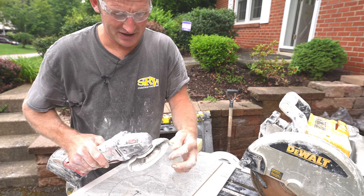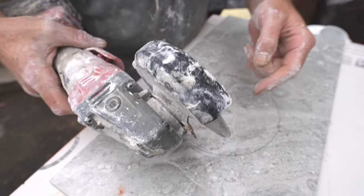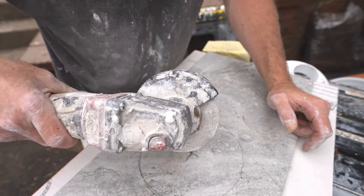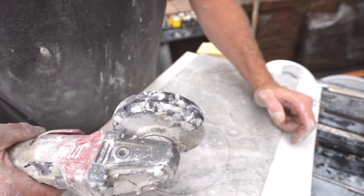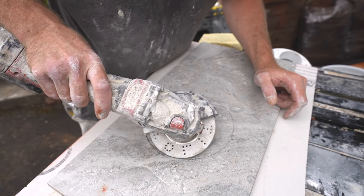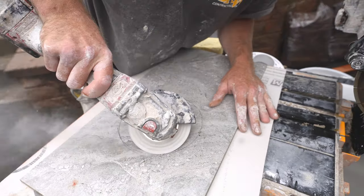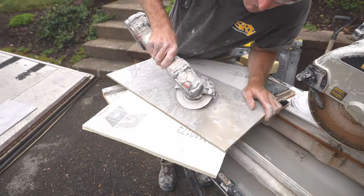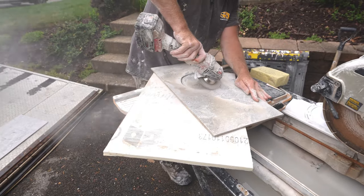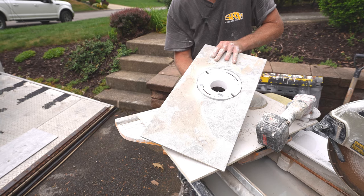Okay, so this STL blade has diamonds all the way around on each side. So it really makes it nice to cut holes in tile, because you can just kind of grind your way down rather than having to deep dive and cut, because going around in circles is kind of tough with a 4.5-inch grinder. But if you can just sand it down and get it, much easier. All right, that should work.